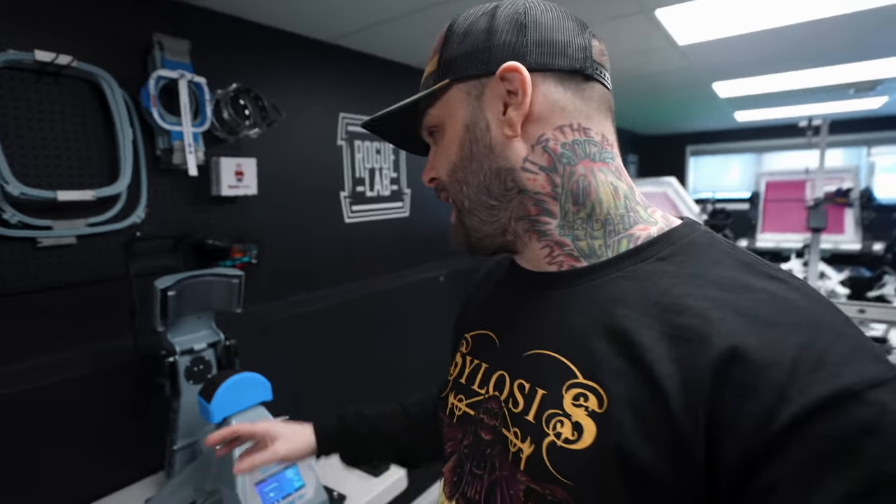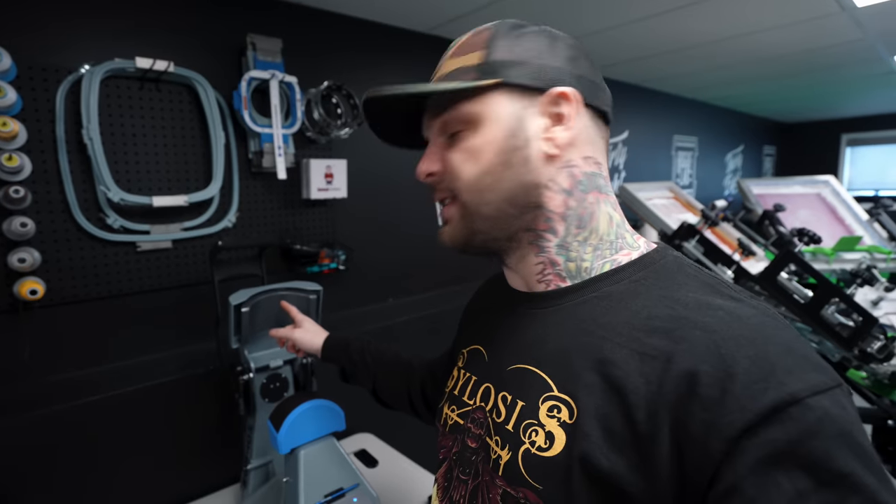The first try went pretty good — having a preset programmed made it go so much better. One little issue did come up: the buckram of the hat — the hard crunchy stuff in the front — started to separate a little from the fabric, which means it was getting way too hot. I had both platens set to 290, which is obviously too aggressive. So I backed the bottom platen down to the 200–220 range and that solved it.